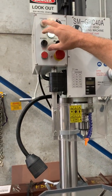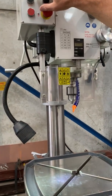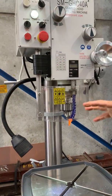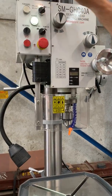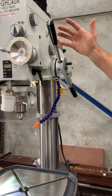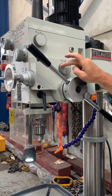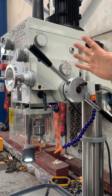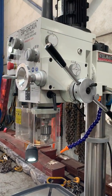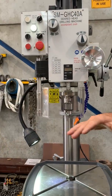We'll run through the drilling now — that's a nice quiet operation as you can see. Switching to the tapping feature, around the side there are additional features: power feed on and off, and three different feed rates. That's the engagement lever for doing power down feed. So turning that on now — this is actually in tapping mode.